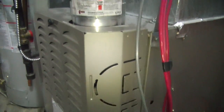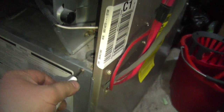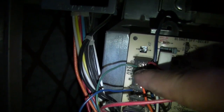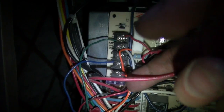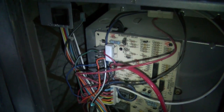The first thing we've got to do is remove the cover. The electrical is behind this panel here, so let's remove it. Once I remove the cover, there's a safety switch right there that automatically kills the power. The 24V common is the second wire down, and that's what I hooked my orange wire up to — that ran into the red one that in turn ran up to my thermostat housing.